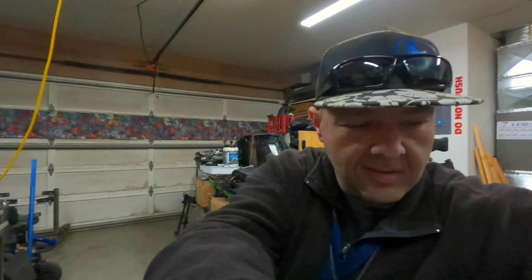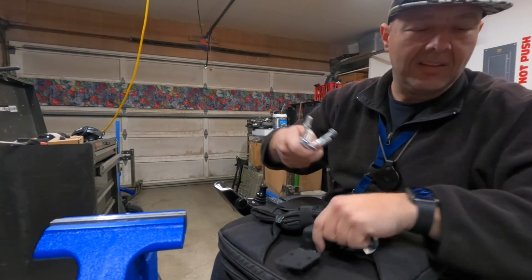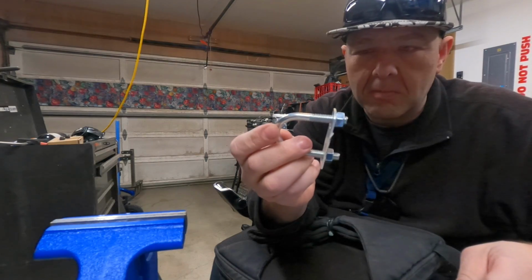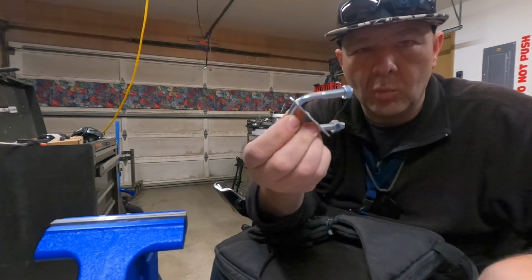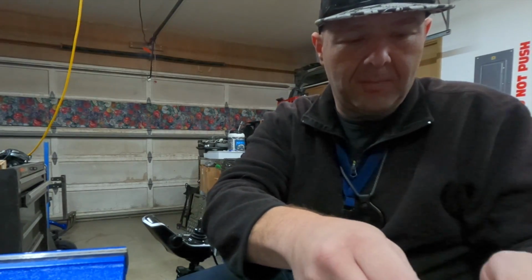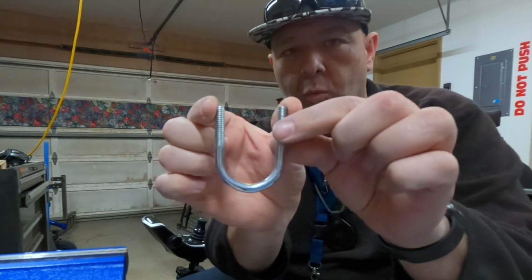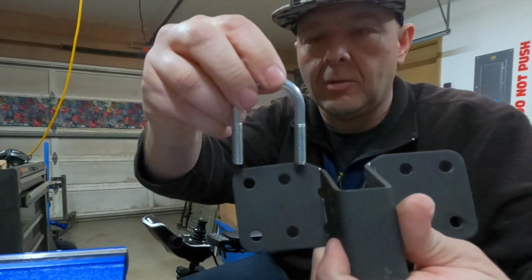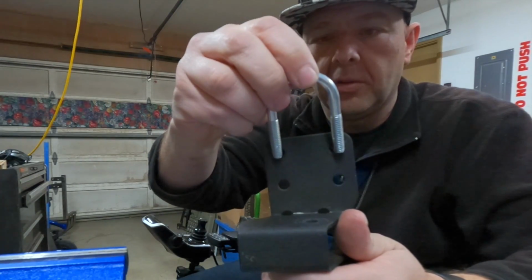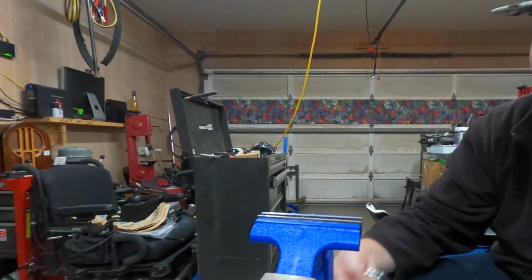All right, just got back from the hardware store, and they happen to have in stock exactly what I needed. By the way, they're called U-bolts, not D-bolts. Whatever. As with most of these things, though, when they're manufactured, they're in a little bit of a sprung shape, where this part is wider than down here. So as you can see, when we try to line it up with the holes, it's really close, but not quite. So we're going to use our friendly neighborhood vise here